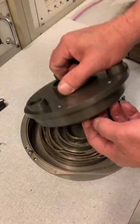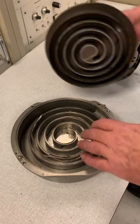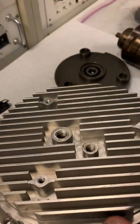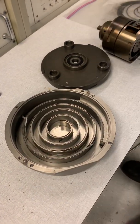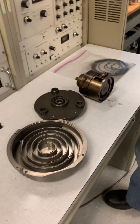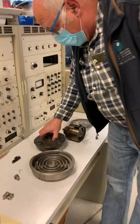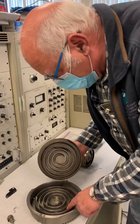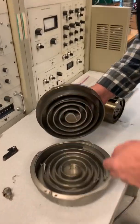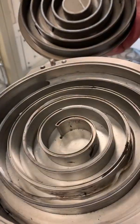As it does that motion, it changes the volume of the chamber created by trapping the two halves together. The valve used to sit here but is no longer present on this worn example. Same principle: varying volume, push it out through a one-way valve. This relies on there being a perfect seal between the two halves of the scroll.